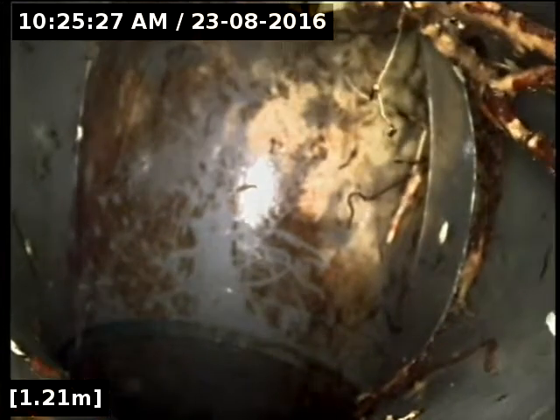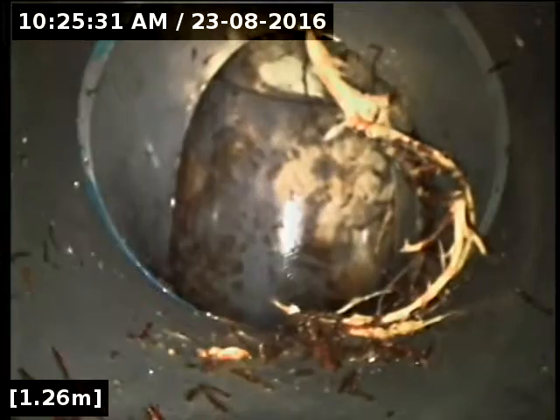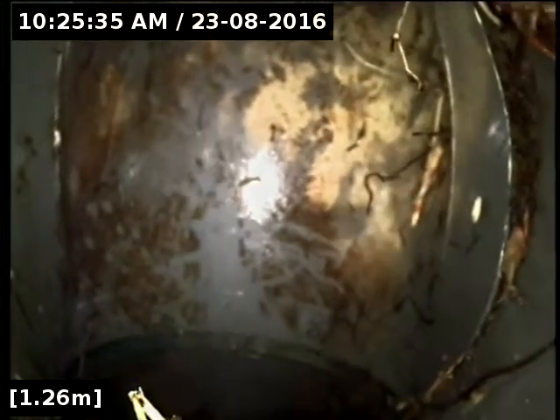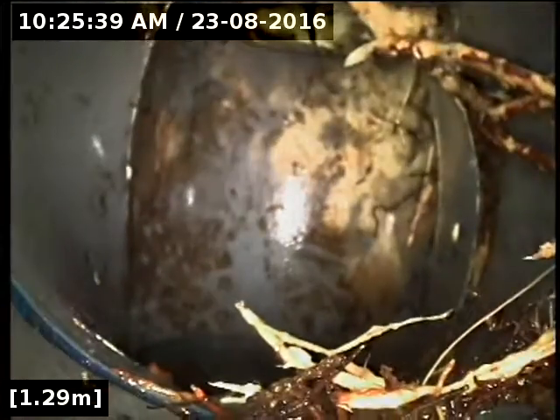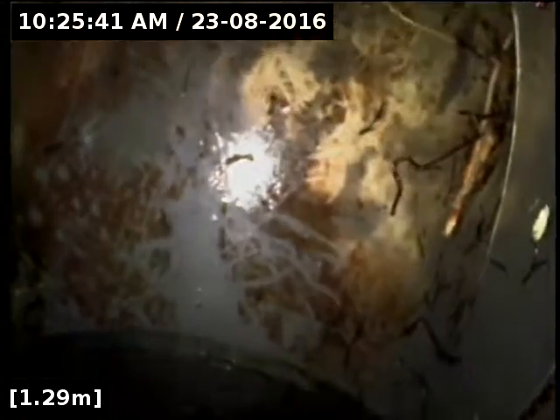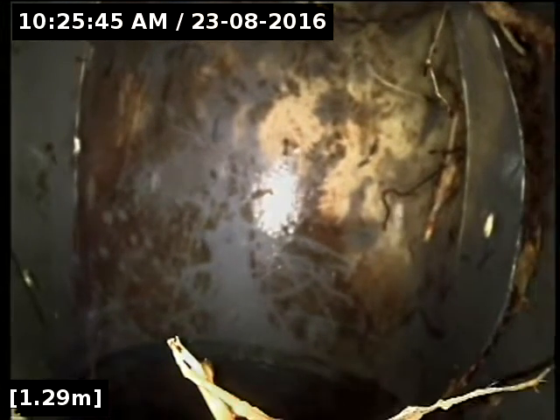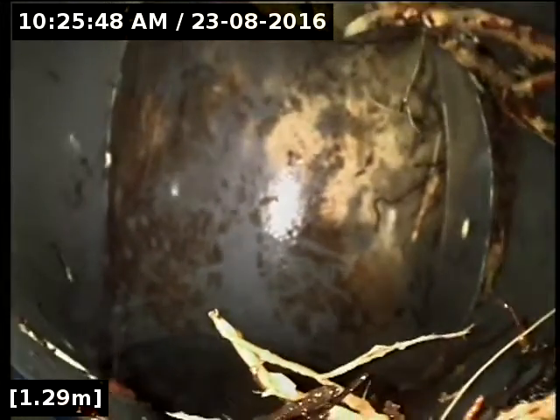You can see these here — these are just loosened now, so I'll flush these away shortly. What we can see is on this tee piece here, they were grown in from — it's blanked on the top, so there's just a cap at the top of it which is buried under the concrete pathway just outside the back door. So they've grown in through the top of that. But also, just on the right-hand edge of the screen right there is a crack in the pipe.